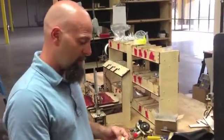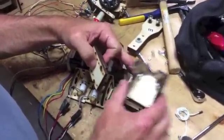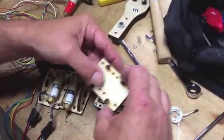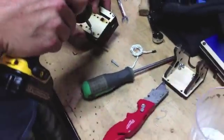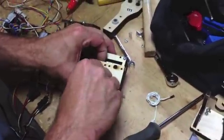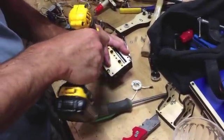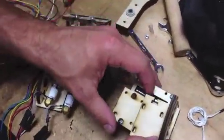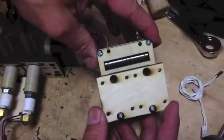I wanted to show you how this mounting plate mounts to the V2 carriage. This is what normally comes on a carriage mount for one — we'll take that off. It has that back plate on there, so it's similar, but it's wider so we can mount with a little more space. We take the same screws, use the recess — the rounded is on bottom, the square is on top. We go through and do all four screws, and then our mounts will mount right on top of that since these are recessed. That's how it mounts on a V1 or V2 carriage.